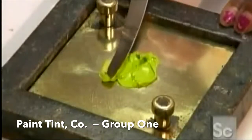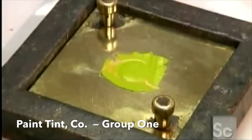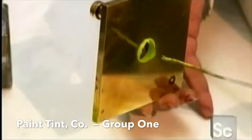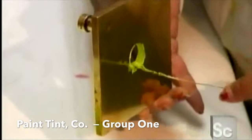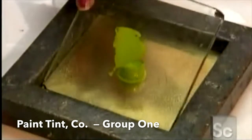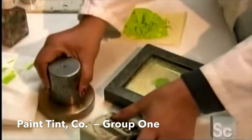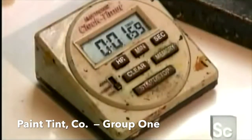The quality control lab takes samples from each batch coming off the mill and subjects them to a series of tests. Technicians scrutinize paint from both sides of the mill to ensure the mixture is being processed evenly. First, a spread test: a heavy brass weight goes onto a blob of paint for a prescribed period of time, then inspectors evaluate the volume of color and measure the distance it spread.